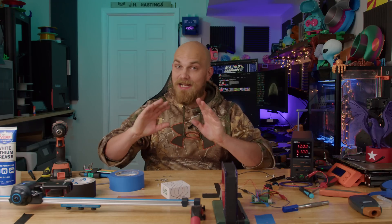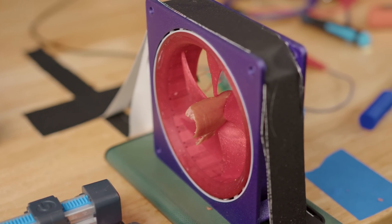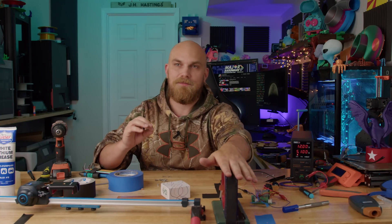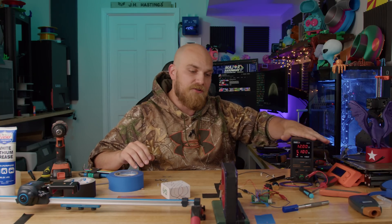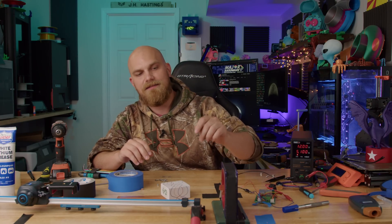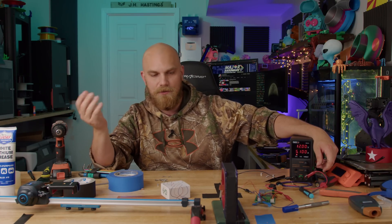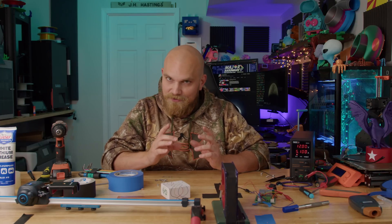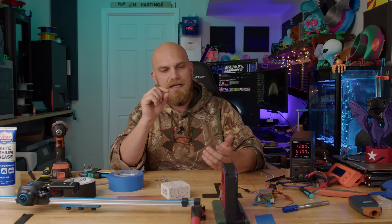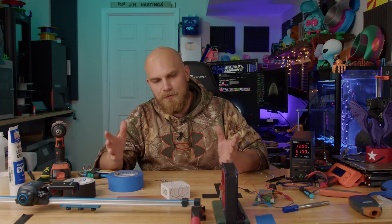The last few days have been a bit chaotic. You learned that this thing's a pretty decent hot dog holder — that's really about it. But it's not a total loss. I did learn a few things: one, the material type needs to be something more heat resistant if we're going to push a bunch of power through it. I should also re-look at how I have my coil set up — it seems like the speed is pretty limited on this fan even with different power sources. And grease and lubricant wise, just a light bit of gun oil or really thin oil around the side is the way to go. Don't want to overload it with anything too heavy.